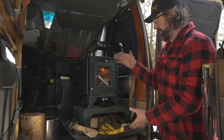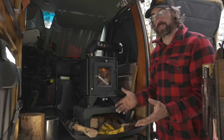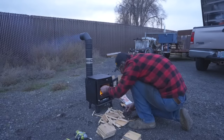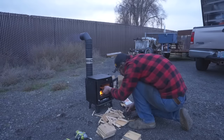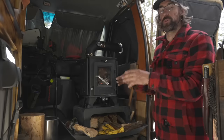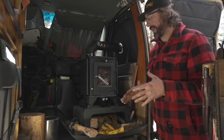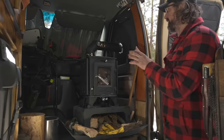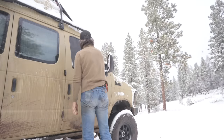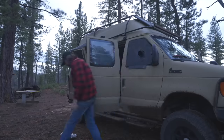The can says do not use primer, so I painted directly onto the metal. I'm really happy with how the color came out — the wood stove color and the rest of the box match pretty well, so it all looks like one cohesive unit. While waiting for the paint to dry I took the stove out to the yard area in front of the shop and lit a fire inside it. There's a lot of residue from manufacturing, so you want all of that to burn off outside — not inside the space where you'll be using the stove. I'm extremely happy with the way everything came together.